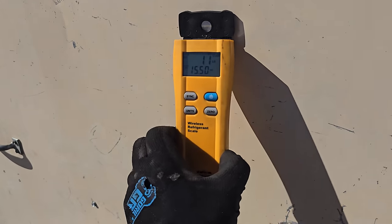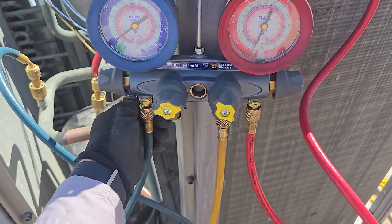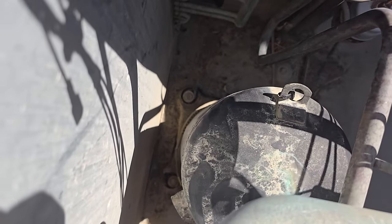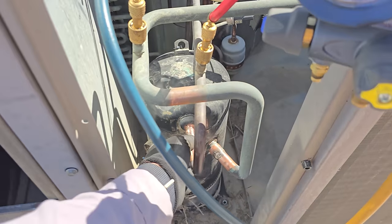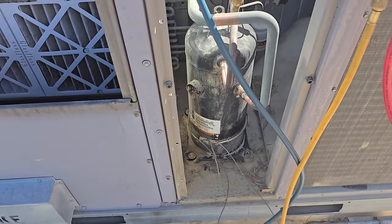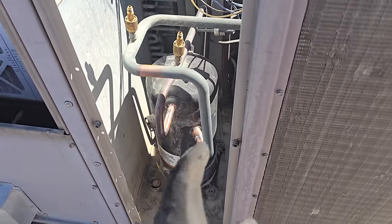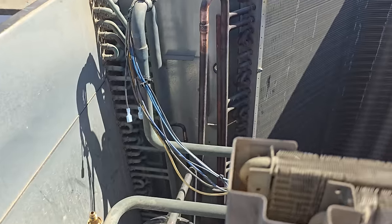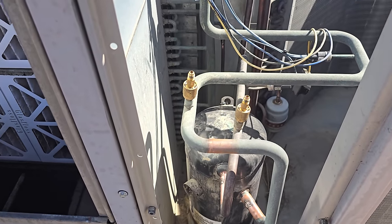Looks like we're right at about 12 pounds of gas recovered. Now there's just a little bit of vapor left in it. We can't get the bolts out for the compressor — they're stuck. They're just spinning on both sides. What we're going to do is try to unsweat the tubes and then tilt the compressor back, putting pressure on it so those bolts will come out. The two on the other side came out no problem. On the plus side, it really doesn't smell very burnt — that's why I'm hoping this just happened internally due to a single-phase situation and didn't blast contaminated oil through the system. With fixed orifice metering devices, there's no real way to clean those except to change the whole evaporator.